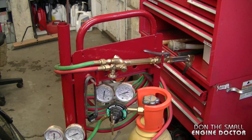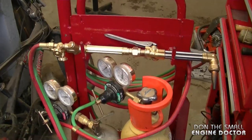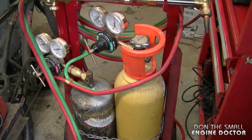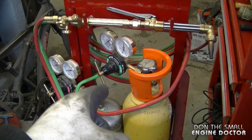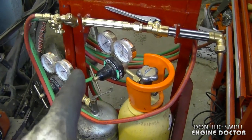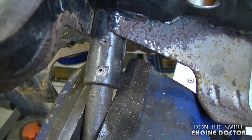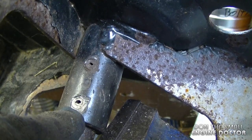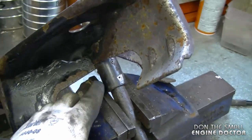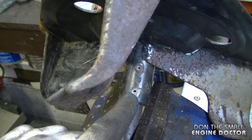If your impeller and the pins are seized, you're going to need some heat. Today I'm going to be using oxyacetylene torches. If you can afford to have a small set of oxyacetylene torches in your shop, it's going to help you a great deal — I also have a video review on this set; there's a link underneath today's video. I can't stress enough how valuable these are. Here's an impeller with a shaft where I tried to remove the pins but they're seized in there — they went down flush to the collar of the impeller but that's as far as they'll go. So what I'm going to do is heat up this whole area, and as soon as it's red hot, go again with my roll pin punch and try to get them out.